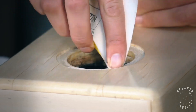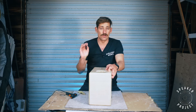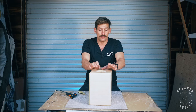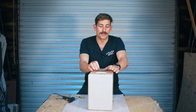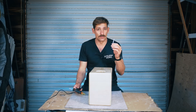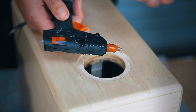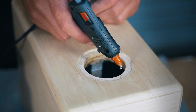Now we're going to apply the hot glue inside the hole. Work fast — you don't want to take too long because it will set. If it sets before the port is in, you won't get good adhesion and the port probably won't sit flat. If you do take too long, just let the glue go hard, then scrape it off and start again. Have an extra glue stick on hand. Make sure your glue gun is really hot — I've left mine on for 10 minutes and it's just starting to smoke at the tip.